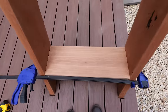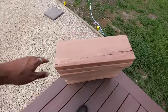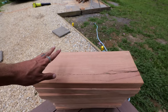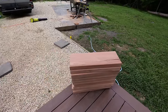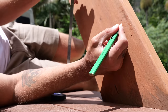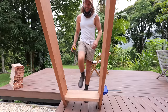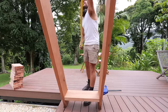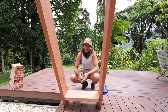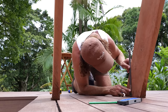Have a look how nicely these stairs are coming up. All this timber I'm using for the stairs is actually landscaping material, which means it's a lot cheaper because it does have some cracks, but I think it adds character — there's still plenty strong. For all of that timber combined it was $130. Now what I've done here is I'm measuring the height to make the stairs — the maximum you can apparently make them while still being comfortable is 250mm, which is currently the height. But I measured all the way up from the top to where the last step can be down, and I've divided by the number of steps I have which is 11, and that makes 230mm, which is better because it means the step height is a little bit closer together.